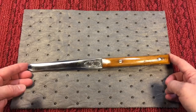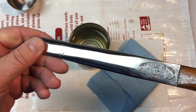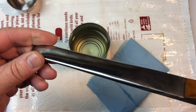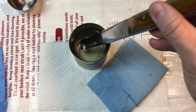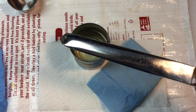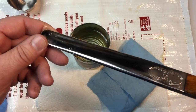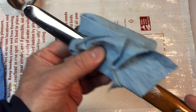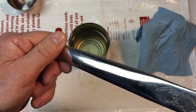A lot of people ask what to do about the finish so it doesn't rust again. When you polish a piece of steel, I put a couple coats of carnauba wax on it. Let me show you — I'm going to dip this in water. I pull it out and you can see it is bone dry. That's because the surface is so polished and shiny that water just doesn't stick. It beads right up and wipes off. Anytime you have a concern, just wipe the tool down with a little oil, and that's good to go.